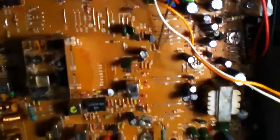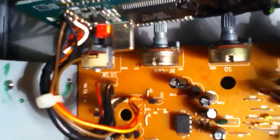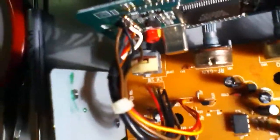That's the RF board. Here is the logic board, or the front panel board — I removed it. There's the back side of the front panel. That crystal right there, I believe, is a 4.5 meg crystal, with the trimmer. And you dial that in for 4.5. In this bundle of wires going to the motherboard is the VFO. And if you put a frequency counter on that, you'll see it, and you can dial that trimmer in to get right on the evens.